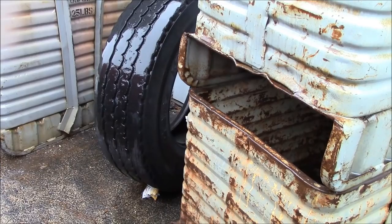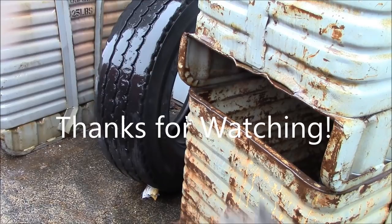I just had a visit from a couple of fellas who are local to me and they made an offer on this truck and I accepted, so I've got to fix a few things but it's basically sold. The windshield wipers aren't working — it's got air pneumatic-powered wipers and I've got to fix that, so that might be an adventure. There are also a couple of issues with the air brake system — the low air pressure warning light is stuck on all the time. It'll fail a DOT inspection if the low air warning light and buzzer don't work correctly, so I'll fix that. Maybe we'll make a couple videos out of it, maybe not. But thanks for watching guys.